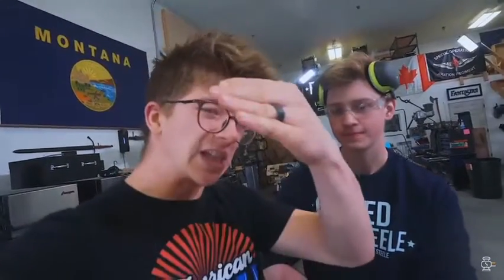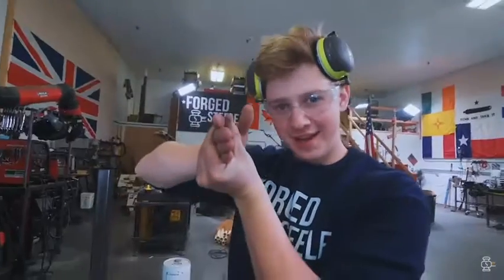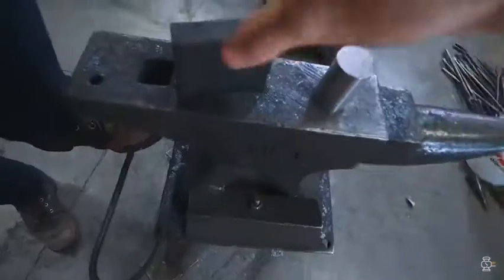This is a similar way that they would have been made historically, except they would have had a wrought iron body, a high carbon edge. We're not going to do it the same way we made the scythe though, where we folded it. Instead, we're going to split it and insert the high carbon edge. It's like you make a taco out of hot steel, and then you put your taco fillings in and forge weld your taco back together. So let's put the material in the fire!